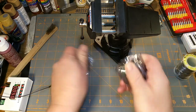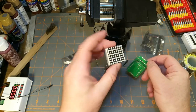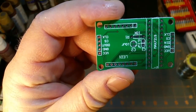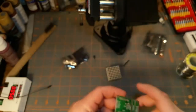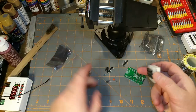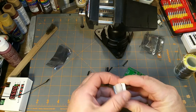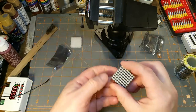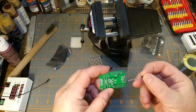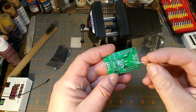As part of that test, I'm going to do a kit build. This is one of these 8x8 LED grids driven by the MAX7219. It's a pretty simple little thing to put together - two capacitors, a resistor, the chip in a socket, and of course the LED grid itself.